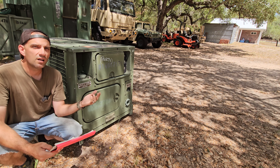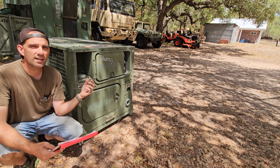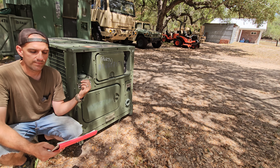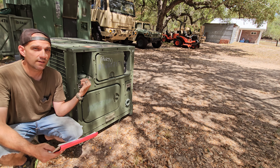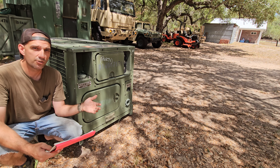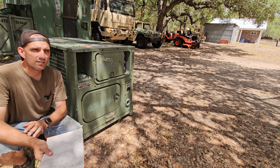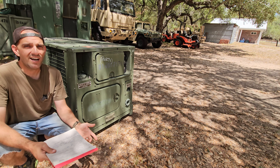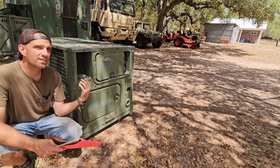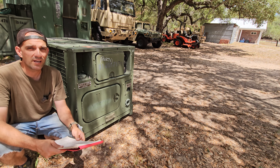What would normally happen on a lot of the older generators is if you put too much of a load on, the engine would kind of sputter out or even stall. The engine on this is turbocharged and it's pretty much oversized for what a 10 kW generator should be, so it was able to push through the issue. With that said — did I kill it? Maybe. Would it have died anyway — a slow death? Maybe. If this got continually used not under 100% load, it may have lasted years and been okay. Probably.